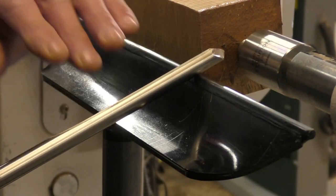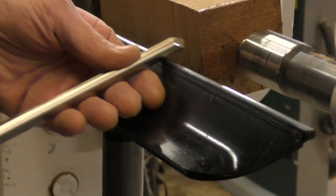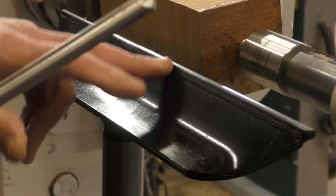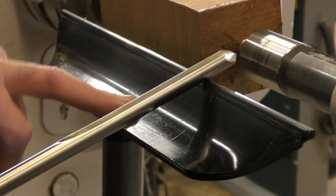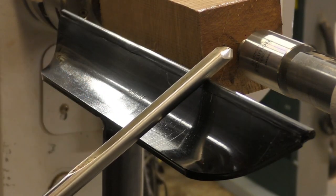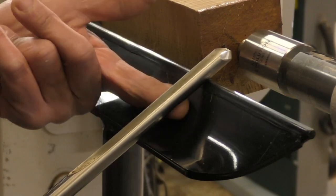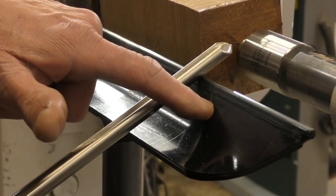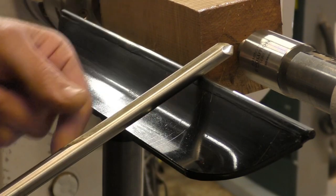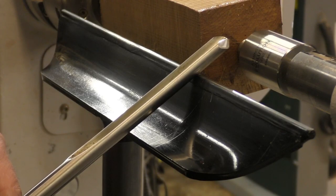These rests also have a very smooth, comfortable area to run your hand across. Whether you use the overhanded or underhanded method, it is extremely comfortable and very pleasant to use. One of the big advantages is that with a standard tool rest, if you lower your handle — especially for a shear cut on a ball — you start to foul on that secondary edge. But because of the clever design depth here, you can lower your tool handle more than adequately for that sort of cut.